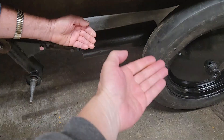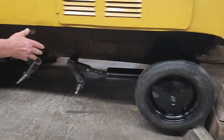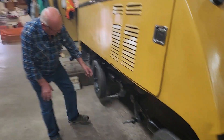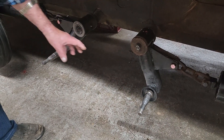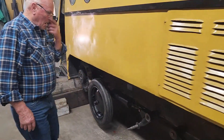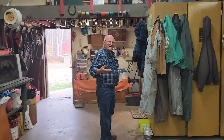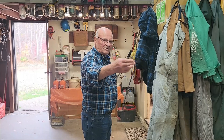If there's no bogey here, this is going to naturally go back and rub against that tire. You've got a brand new tire there and a half decent one in the center - one of them is going to go for nothing or you'll wreck them both. If one of these breaks, you'll know right away - you should hear it flopping or it'll jam your track. If you can take the wheels off, you pull the chain from here to here, hook it, put the wheels back on and you'll be able to get home. Pay attention - if you hear that banging and it jams on the track, it'll wreck the track or the track will come up and smash your tunnel where you're sitting.